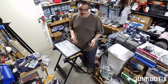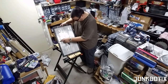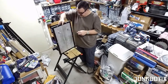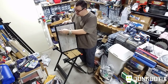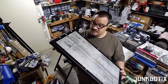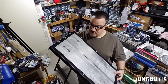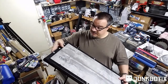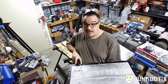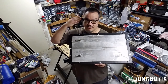So after I shut it off, I decided to go ahead and drill this out, and I drilled it out. You can see I mounted these extra bolts and whatnot, and also mounted the angle brackets up here. Those brackets are what are going to support the motors, partially — at least the main body of the motor. I'm going to soon be making the bearing blocks that go here — one on each side — one down here to support the wheel on this side, and one up here to support the wheel over here.